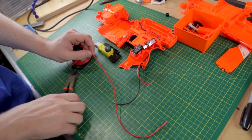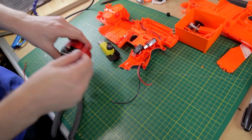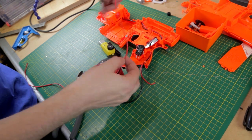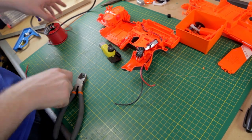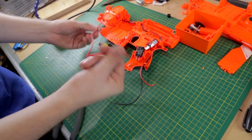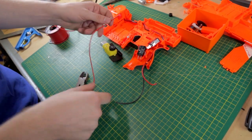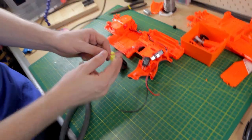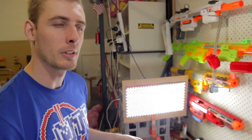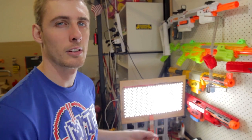So the way I do this is I will just lay the wire roughly in the right spot and cut it to length. And then I'll solder one side that is non-essential in the length and then just cut it to the right dimension later. So this is much more wire than I actually need for this, but when the whole thing's done, I'll solder the plug last so I can clip them both to the same length. The old adage is measure twice, cut once, but I measure once and cut twice and it works just the same.